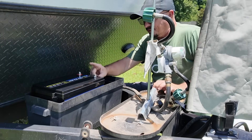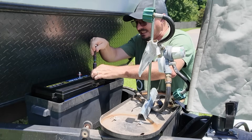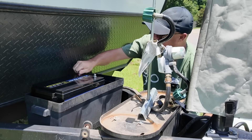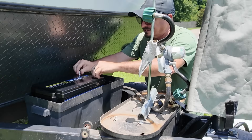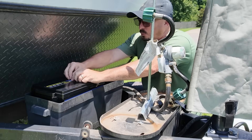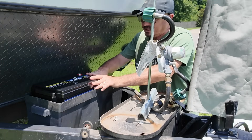Back to what I was saying about this battery — it is heavy, comes in at around 60 pounds. I did not do a capacity test on this battery because my test equipment only goes to 10 amps, and really to do a discharge test you need to be pulling 0.1C, which would have been somewhere in the neighborhood of 31 amps to get good readings out of it. So I'm going to just have to trust WattCycle on this one that it is 314 amp hours.